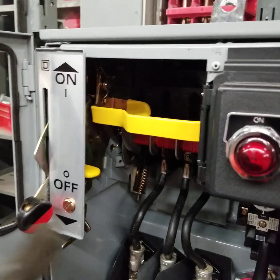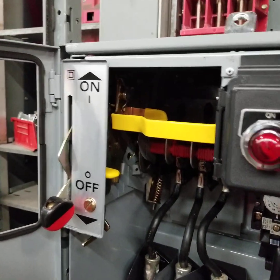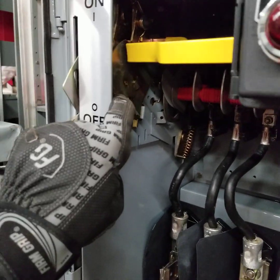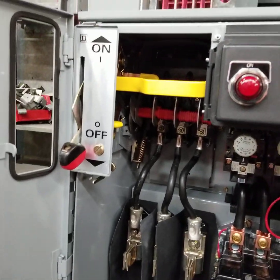This racking mechanism has two interlocks. There's a top interlock here behind that comes forward, and that's going to allow me to pull the switch back. After that's accomplished, there's another interlock that I have to press down to get the whole frame and bucket out — so it's a two-step process.